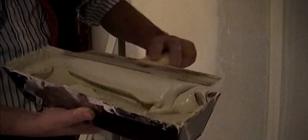Watch how William uses his 10-inch knife as he starts removing the excess all-purpose compound. He's using long even strokes and laying his knife lower to the drywall on his final pass. Then, when William is finished with this flat, he will use his 10-inch knife again to see if he pulled too much compound out of the flat.